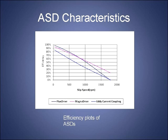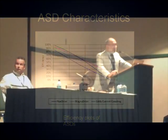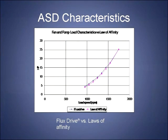It's comparable. It depends on the speed you're going to be operating at, but there are some other advantages that cannot be ignored. This is relevant to the type of load we're constantly using in our testing here, which is blowers. And they have this unique behavior that is captured by what they call affinity laws. These affinity laws say something very interesting: if you have a blower and you want to cut down the amount of air in half, what you normally do now is maybe block half the fan or do something to cut down that amount.